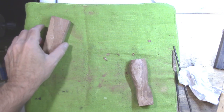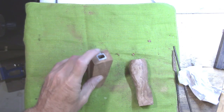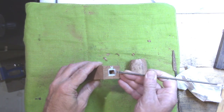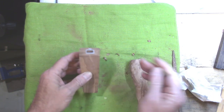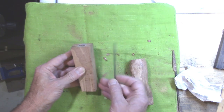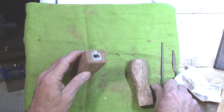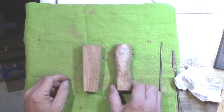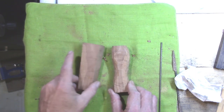Let me show you what kind of progress we've made here. Taking the blank — we had two blanks and drilled a hole down the axis, then opened the hole up on one end with this tiny little chisel. I had made this a long time ago for working on stone, but I sharpened it to a razor edge and it's just the right size to get in there and chisel out clearance for the tang of the drawknife. So then I started whittling on it.